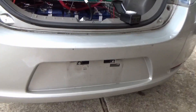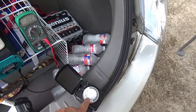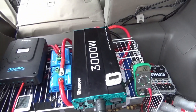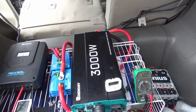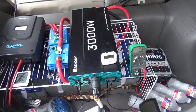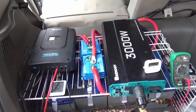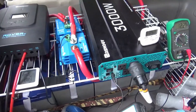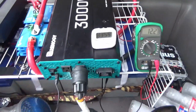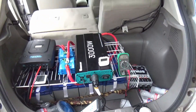That is automatic voltage regulation — it removes all the guesswork from the equation of using the timer. It takes us one step closer to the final version of this system, where you would be able to plug your EV in and walk away. The voltage — and eventually the temperature too — will be completely self-regulated. Park it anywhere, you don't need an outlet, you don't need to worry about your batteries getting depleted, and this will keep your EV topped off for you. I'll probably do another little video showing the charge going back up and these things automatically reconnecting the inverter and turning the car charger back on when it goes back above the programmed 12.8 volts.